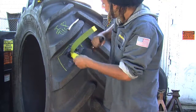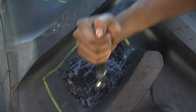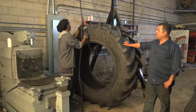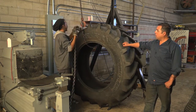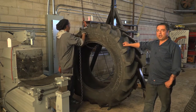You've seen the repair on a typical agriculture tire. We put a lot of work into it. Now we're going to put it on the machine and let's cook it. What this machine does is pretty much like an oven for the tires and the patch. It'll cook it at about 450 degrees, all evenly. And that's the secret to such a beautiful, vulcanized job.